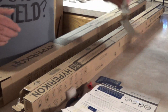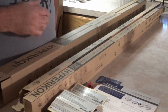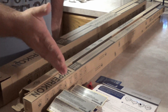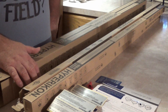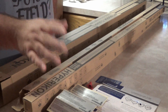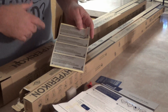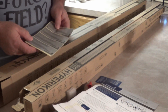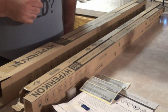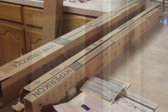This is more of a 'do as I say, not as I do.' It conveniently comes with some stickers to put on the inside of the fixture to warn the person who comes after you. Because there is an issue: if you try to go back to the old bulbs, there's a risk of shorting things out and possibly hurting yourself. It's prudent to make people aware in your household that they should not replace these bulbs back to fluorescent without first reconnecting the ballast the way it was originally.